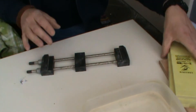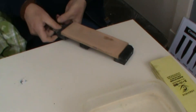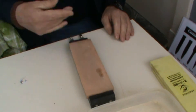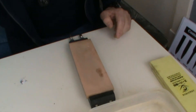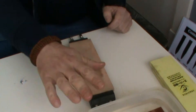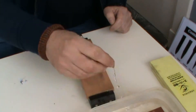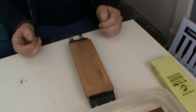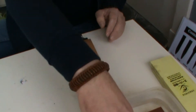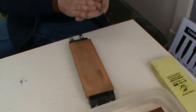What I love is these clamps to put your stone in. I start with the 800 grit stone — put it in like this and tighten it with two screws so it won't slip on the table. I make the stone wet — that's just enough. When using a traditional water stone you have to soak it for 10 to 15 minutes. When sharpening, always make sure there's a small layer of water on it — don't let it get dry. Same for these stones: they shouldn't get dry.